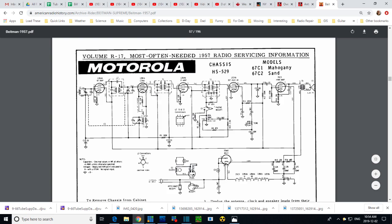I've commented on what's on this wire in past videos and wasn't quite right. On this wire should be a combination of just about everything that can come out of this tube, but anything that comes out that is not 455 kHz will see this circuit as nearly a short circuit and gets consumed or snuffed out. Only 455 kHz survives when it meets this high-impedance tuned coil. So on this line, all you'd really expect to find is 455 kilohertz.